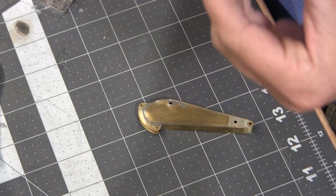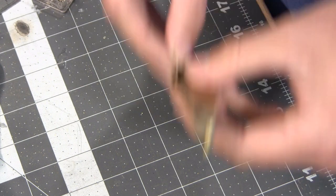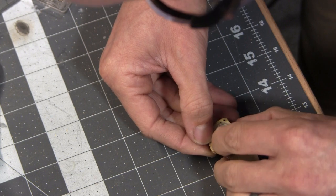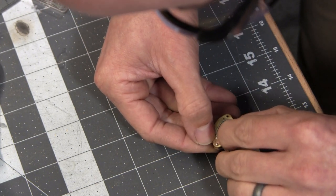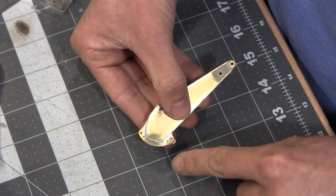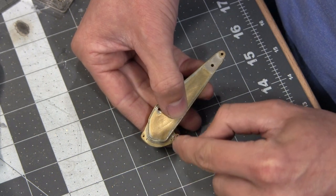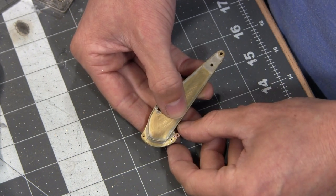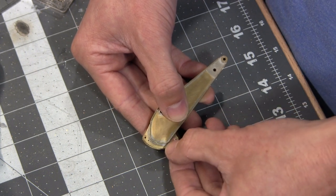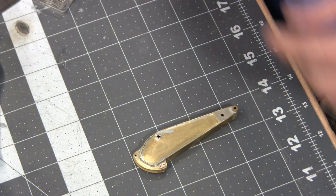Let's see if these lock pins work. Hopefully I didn't mix them up — I think there's a chance that I might have. I'll make sure this hole is lining up. So this inner hole is the 0.8mm hole, and I basically did a ghetto tap job — I just ran the screw into it which threaded it. And then this outer hole is a millimeter, just a little bit bigger, so I don't have to worry about threading it — it'll just run through and lock it in place.